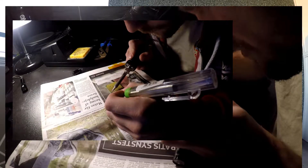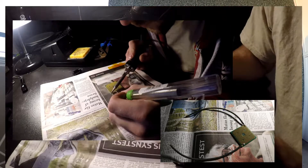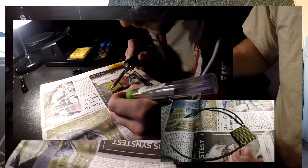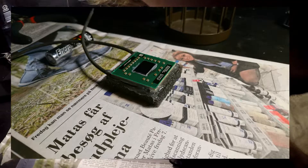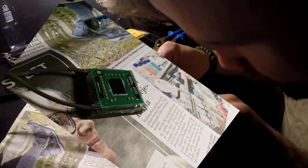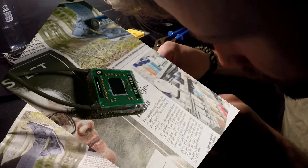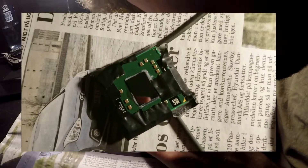When I was finally happy with my choice of pins, I soldered on the wires. Now I don't solder that often, and it really shows here. After the solder, I used some hot glue to keep the wires in place. I also cut a small piece of foam and put it on the back of the assembly to avoid unintentional short circuits. Adding a battery to the wires from the CPU was no issue, so tape did the job very well.